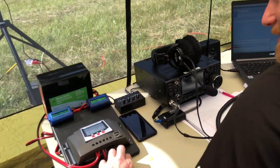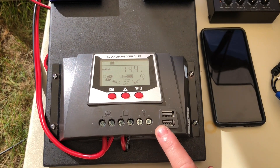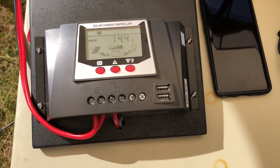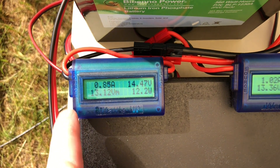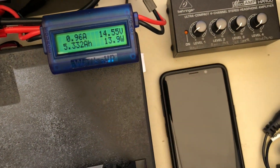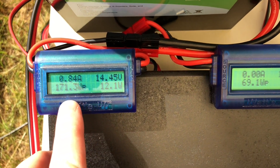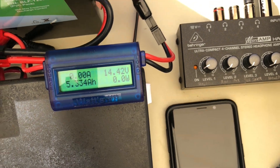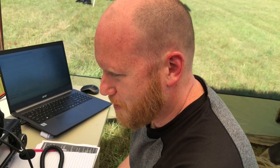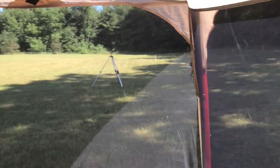Tell the kids about the solar setup. He's got a 30-amp solar controller with two meters — one measuring load going out of the battery through a rig runner, and one measuring what's going in. The battery is topped off — only getting an amp in. So far today he's used 3.7 amp hours and put in 5.3 — free electricity! Very quiet, no noise. Bioenno makes good stuff. This is the inside of the 'love shack' — this is where the magic happens.